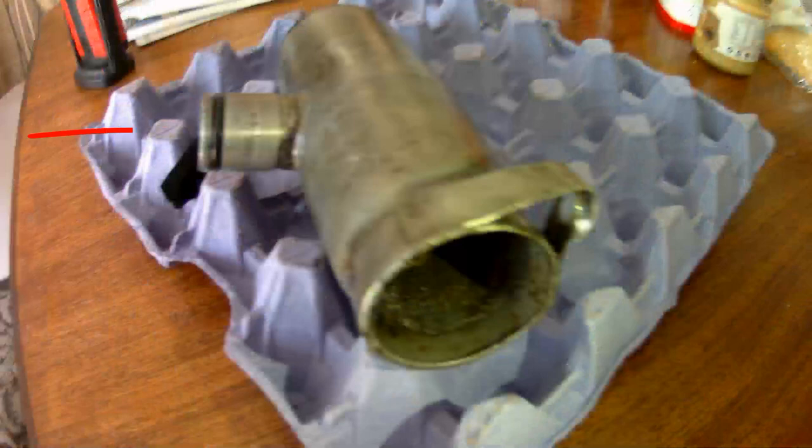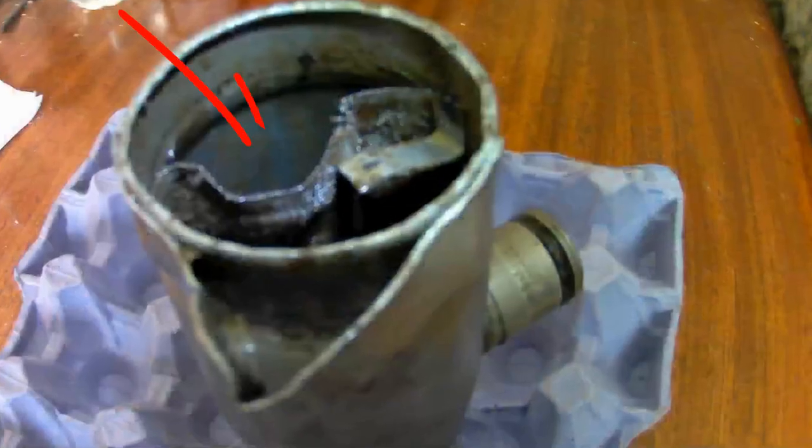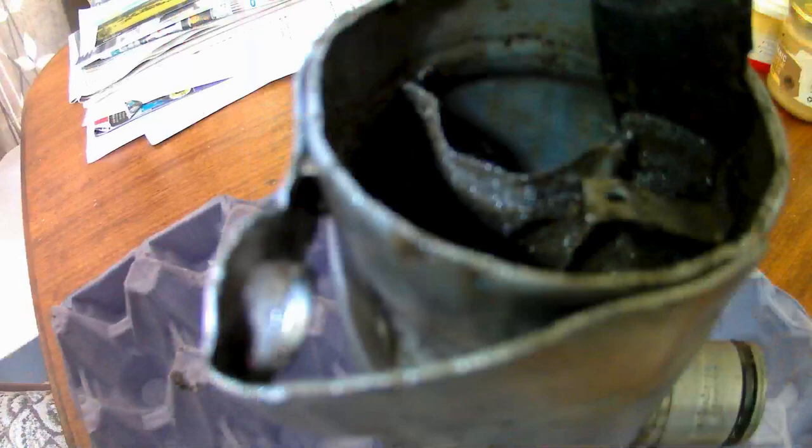So this is the hydraulic oil strainer, and when I put my finger in there and use my fingernail to scratch inside, that should be a wire mesh feel. It did not feel like that. So I pried back the wire mesh to further inspect between the layers, which I wouldn't have thought there'd be anything in there.